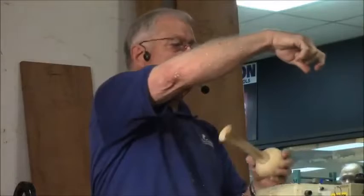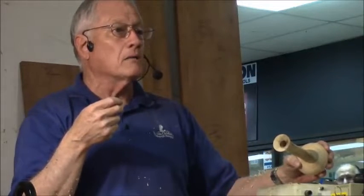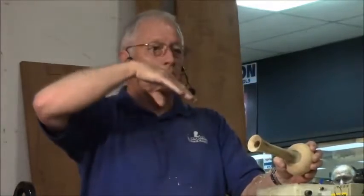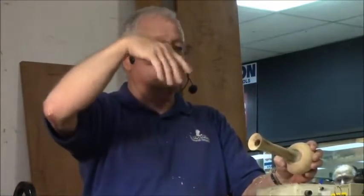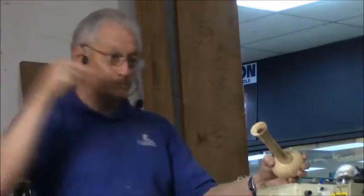But they're long, so you get a long bit, and on the end is carbide, and they're hollow. And what they do is, when you're making a gun barrel, and I don't care whether you're making a pellet gun or a 12-incher for a ship, it's all done the same way. There's oil that's forced through on a big, huge lathe, turning very slowly, and the shavings come out because the oil is coming through. You don't start and stop like we do with a wood bit. On a deer rifle or something like that, you drill it all at one time, one pass.